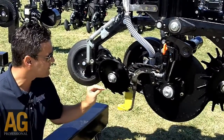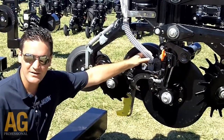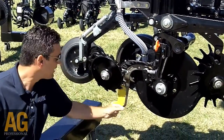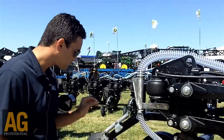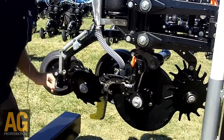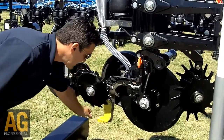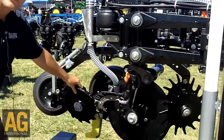The really interesting aspect of this design is how we treat the dry fertilizer. The granular fertilizer is actually injected ahead of the ammonia, which allows it to go down into the furrow and reach the full depth of the furrow, and have a known quantity of fertilizer hitting a known depth location — without interfering with what we really need to achieve to seal the maximum rate of anhydrous possible, which is an exact relationship between the front closing wheel and the trailing edge of the knife. The plastic unit also has an unusual surface geometry that forms a seal against the furrow and channels any vapor backwards underneath the closing wheel, so we're not releasing the fertilizer until we've already got the furrow sealed on top of it.